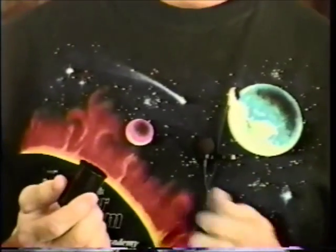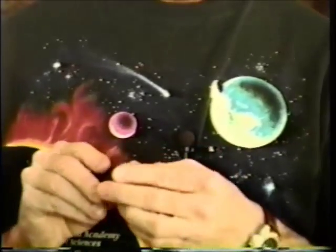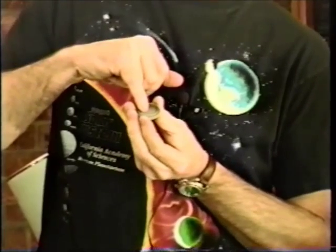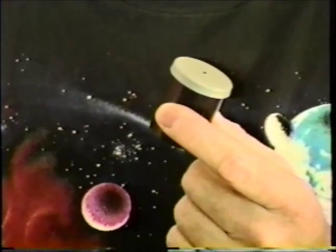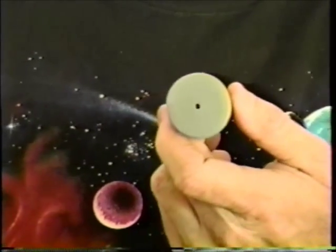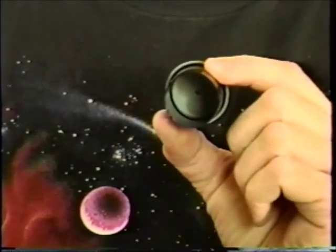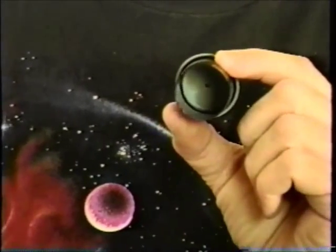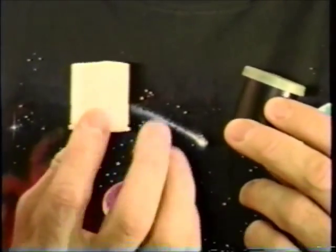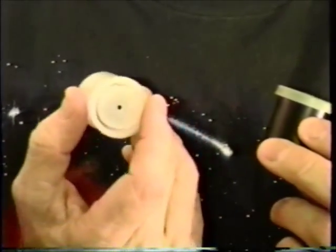Just take it, throw away what's inside, cut off the bottom of the can, and drill a small — maybe eighth-inch — hole right where the casting dimple is in the top. Your peep sight alignment tool should have a one-eighth inch hole in the top, the bottom cut out, and you can see clear through it. It's probably a good idea to make two, one out of a somewhat clear plastic. This will allow the light to pass through and illuminate the inside of the peep sight tool, which is helpful during alignment.